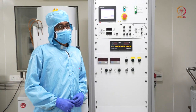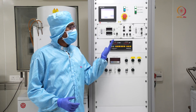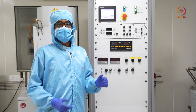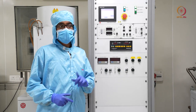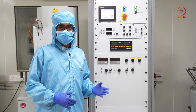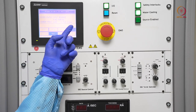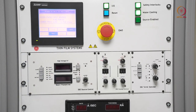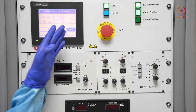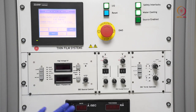After starting this vacuum cycle, we waited for almost 2 hours to reach this vacuum level. It took 2 hours because we are just bringing it as per the pump's efficiency. If we could have used liquid nitrogen, it would be done within half an hour or 45 minutes. Here you can see the chamber pressure measured by the penning gauge — it is 3.7e-6 mbar. Around 4e-6 mbar or less will be good enough as base pressure, and 3.7e-6 mbar is good as base pressure for any deposition technique.